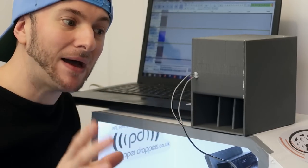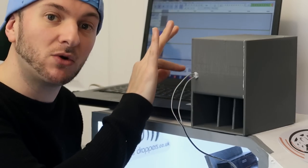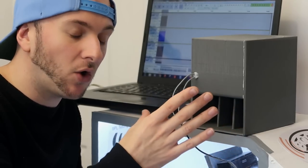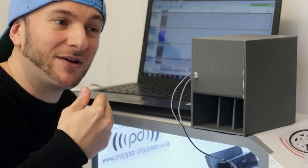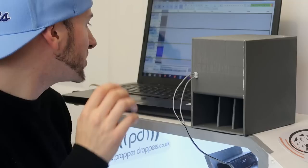Now that might be able to be calibrated better with a different volume of seal chamber, so that the air spring inside aids one of the frequencies that the horn is actually loading the cone at, rather than one where the horn has let go of the driver and the air spring is further aiding its movement. That could be calibrated a little better, I think. Let's try the next one up.